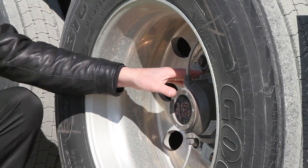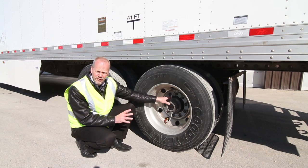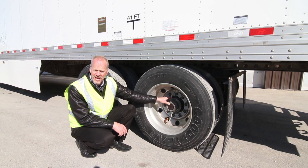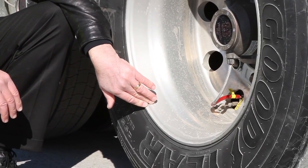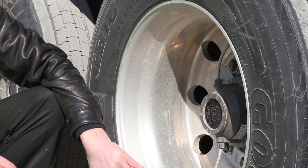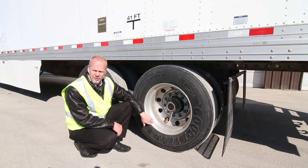The wheel end hub is also a very high tensile steel, but lightweight, built to last the life cycle of this trailer. We used to use aluminum hubs with a replacement plan every eight years, but we've now found a hub on the market that will give us the full life cycle we're looking for. The aluminum rim is very lightweight and reduces the overall weight of the trailer. The brake drum underneath is also a very lightweight, high tensile brake drum designed to reduce overall weight.